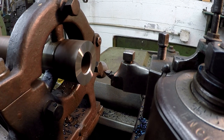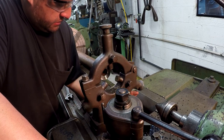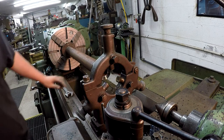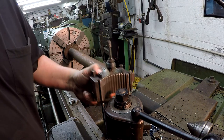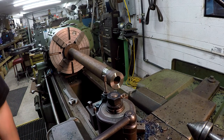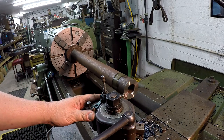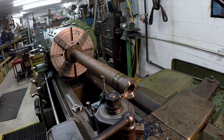I've got my Armstrong tool holder in there with a 60-degree threading tool that still has the good factory grind on it. What we're going to do is cut a small center on the ID there for our live center to go into and hold it. I don't want to finish this bore — it's going to be bored and threaded on this end. I'd like to go ahead and finish the OD and get all that done, and leave the internal threads here for the last step in the lathe. I always try to use minimal stick-out on the tailstock quill to improve rigidity — I stick the tool in, get it lined up, and then run the tailstock quill in with just a little bit of wiggle room.